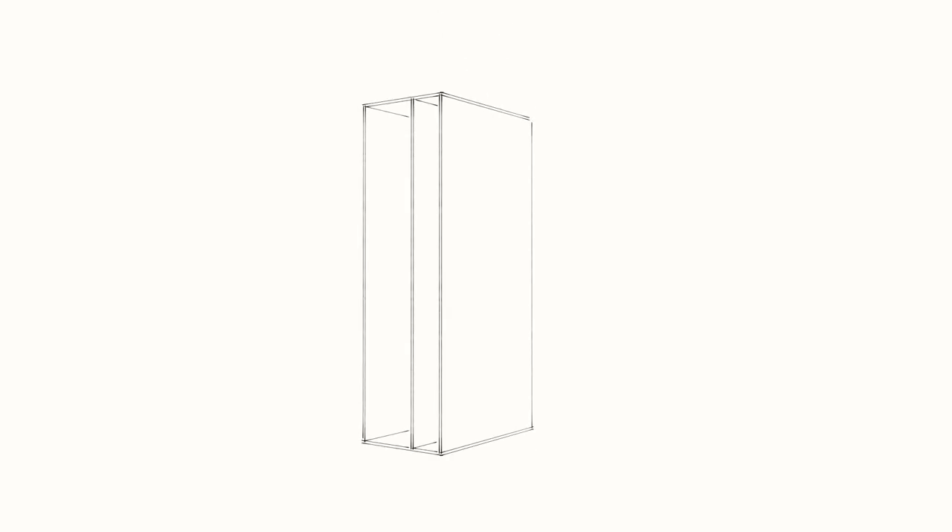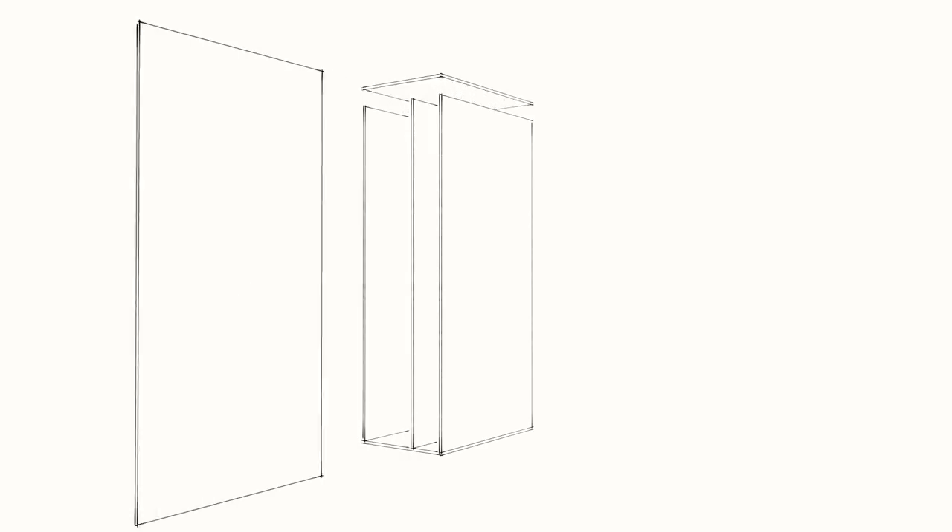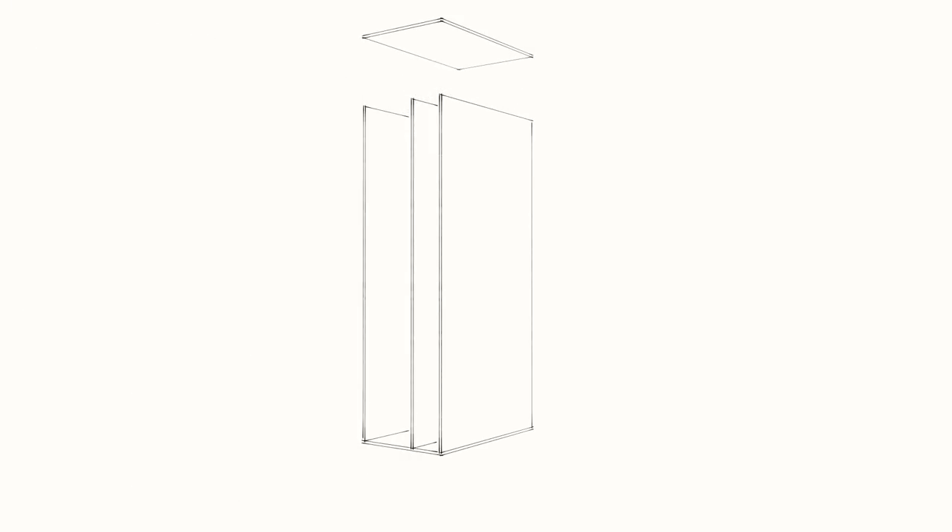There's a top and a bottom as well. The way I first had it designed led me to a problem: sliding a full sheet of plywood into this would basically be impossible since the opening is exactly the same size as the plywood. I thought about not having a top, but that would be bad for structure and dust, so I put the top back on. Instead I decided to put some spacer strips on the top to make the whole thing an extra couple of inches tall, and that solved the problem.